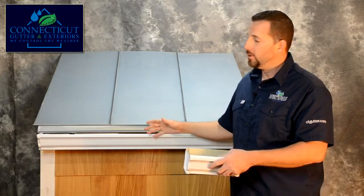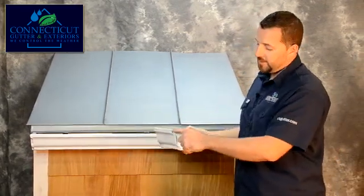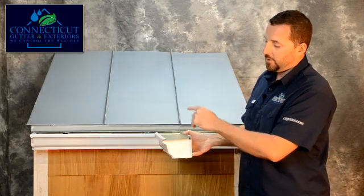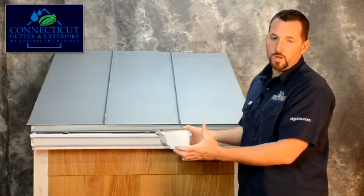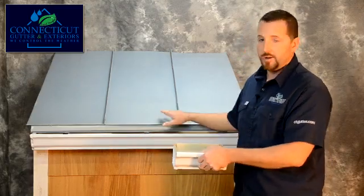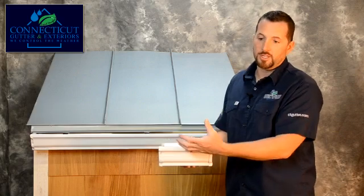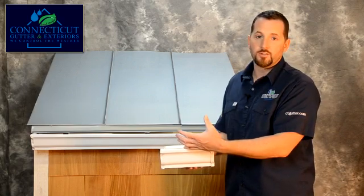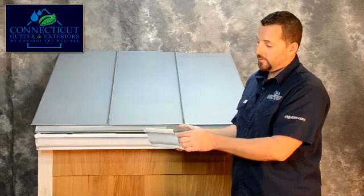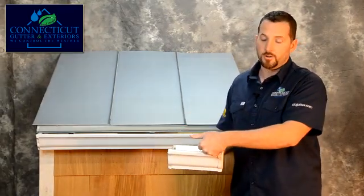Major problem. The other hood concept is an all-in-one, and they take the same piece of aluminum and they form a gutter and the hood out of one coil of aluminum. Again, very problematic because now this time you're not under the shingle, but you're collecting ice. The molecular adhesion factor is nullified with dirt and debris. And the other problem is you have a void in the front, you have a gap. That's how the water finds its way into the gutter.